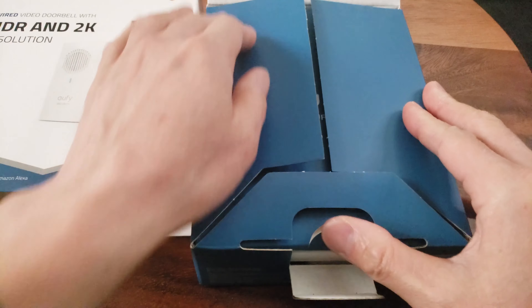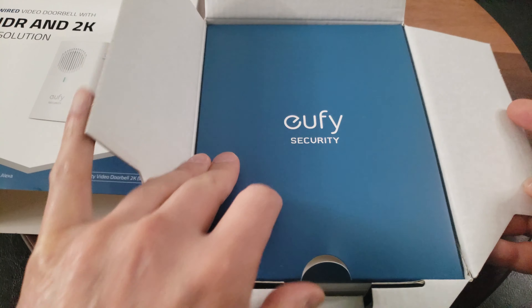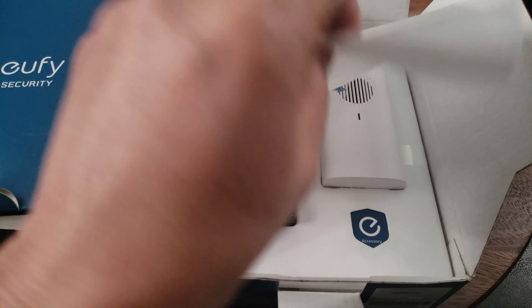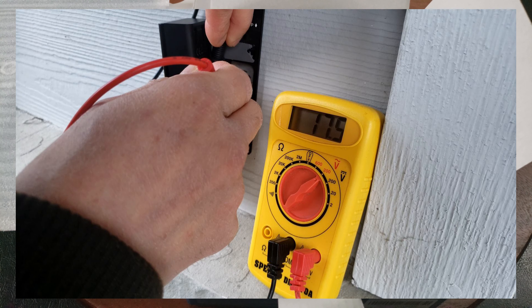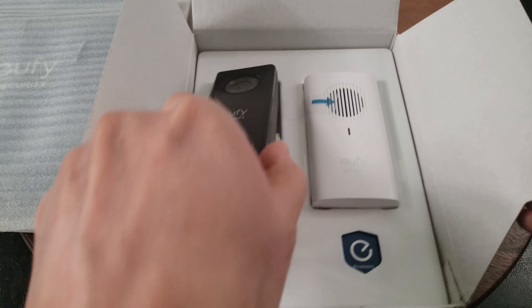So I mailed this three weeks ago and finally got it with a prepaid envelope. They were saying the old unit was probably faulty — that's why it couldn't provide two-way audio. I checked the voltage; the lines provide 17.5 volts AC and they say that's sufficient enough to power it. So let's go ahead and test that out.